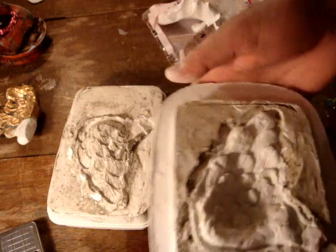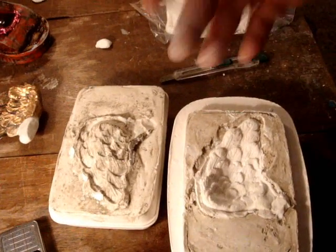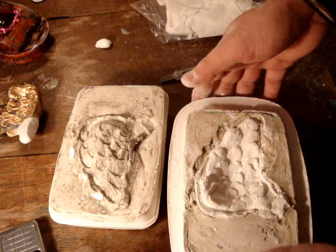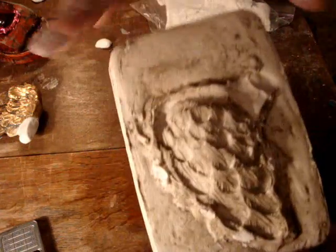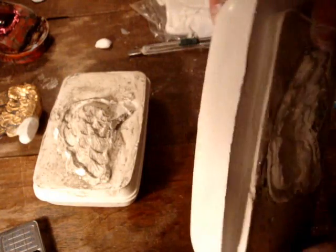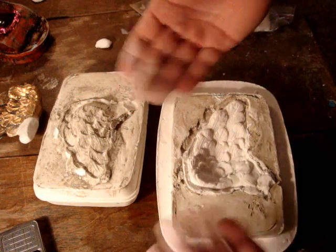So that's basically how to cast the wing. That process from start to finish took about two, two and a half hours really to get it right. Now what I can do is put more plaster, put these in a bigger block so that they don't break. At the moment it could be a bit thicker because when you're applying pressure there's a good chance that you could crack it. So you want to try and have it a bit thicker than that, because there's no point spending all this time and work to get it to this stage and then cracking it on your first mould.